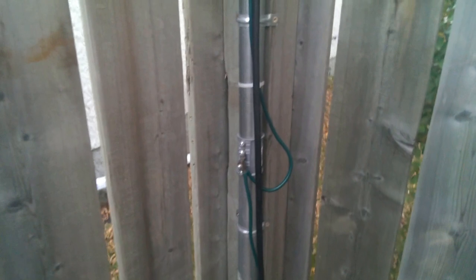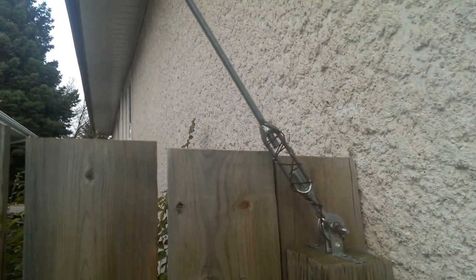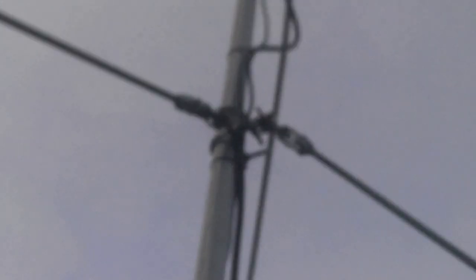The mast is attached to the fence with just the standard EMT straps — I've got a few of them on there. I've coupled it with a smaller chunk of mast to give it some extra height, so it's longer than 10 feet. The supports are actually made out of threaded rod, and on either end I've got some turnbuckles, up at the top and down on the fence. They're just anchored with L brackets and a bolt, and up at the top using a piece of flat steel and U-bolts to attach them to the mast.